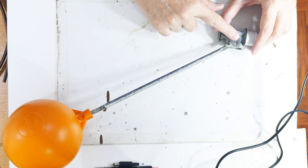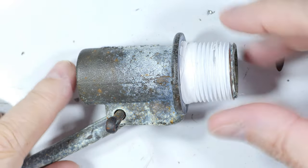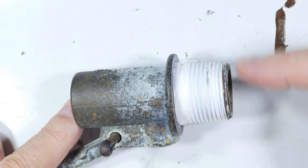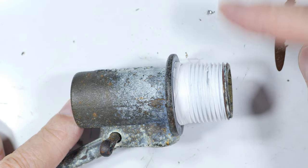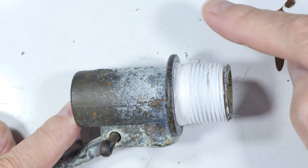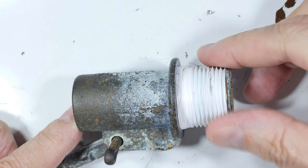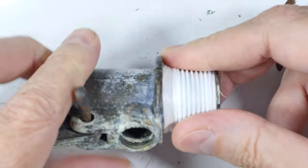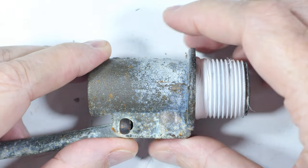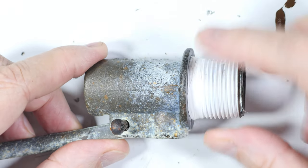This is the shaft. This is the valve. The valve body comes in two types: this one is a straight-through, and there's another type where it turns into a 90-degree. With this one you'd have to supply your own 90-degree fitting coming in from the top of the tank or wherever your water supply comes in. The other type has a 90-degree brass fitting built in and you screw your water pipe directly in there. The advantage of this style is that you can have your 90-degree in place and just screw this valve body into it. With the 90-degree type you have to rotate it around, which in a small space can become difficult. They each have their advantage but I kind of prefer this style.